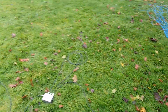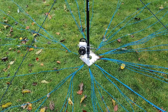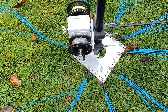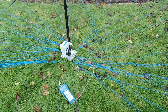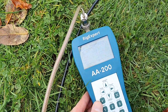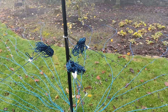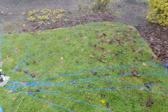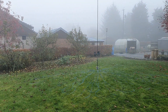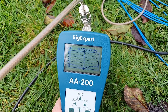So this is extremely interesting. I moved back the second vertical, so this has now got quarter wave spacing. But the vertical is actually completely unwound because I wanted to test one antenna at a time — so it shouldn't be having any interaction with this antenna. Let's check this out. It's exactly the same, which I find incredibly strange. I think what is causing an effect is something to do with the location roundabout here. So I'm going to wind in this antenna and check the SWR, and just as a quick test before I swap over to the other antenna, I took 20 meters — and that's absolutely perfect, so there's no interaction there at all.